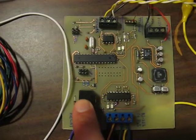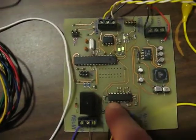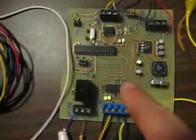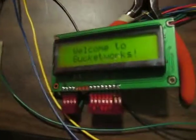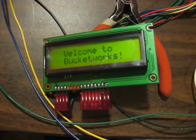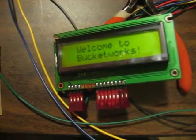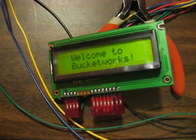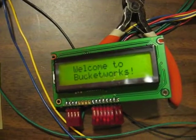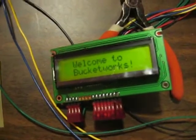or not to fire at this relay. If it's access granted, obviously it fires it. If not, then it doesn't. Whether or not it's granted or denied, though, it once more copies the packet over to the RS-232 side, over to the exterior unit, so that the exterior unit can display a message on its LCD screen, to give the user feedback as to the fact that his access has been granted, or possibly an explanation as to why it was denied. Perhaps the user subscription has expired, or maybe today we're just fumigating for mice or something.